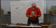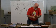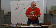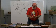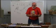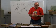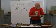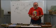This is just a piece of, I think it was a bit of swamp gum or something, but it was just a chunk I found in the bush and had been lying there for a long while. Obviously dried out, it's got a crack in it, and it seemed to be quite dense. Well, ideally you should use things like boxwood and cherry wood, pear tree, they're lovely dense timbers. They're fairly pale, so you can see what you're doing fairly easily on them. This was a little difficult because of the darkness of the timber.